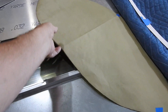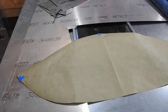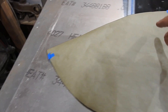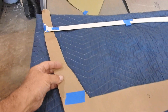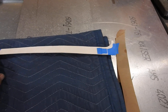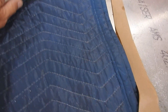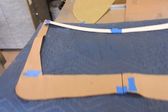I peeled off the stuff there, but this is kind of what I ended up with. This is the pattern — basically what the windshield looks like. I had to take the plexiglass off the front windshield and make this pattern. I made it about a quarter inch longer on the bottom and then drew up the rest. And this is how big the pattern had to be to make the frame to go around the sides, across the back of the top and the sides. And then this strip was the front strip — it kind of goes on like this, with the radius I put in the corners to match when it goes on here.